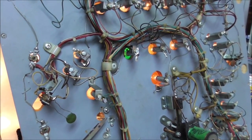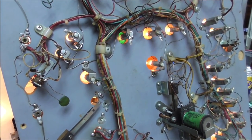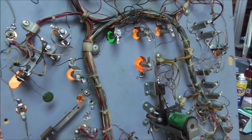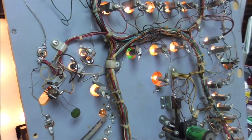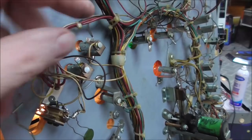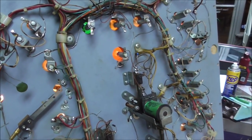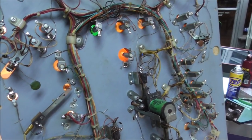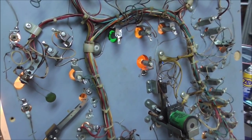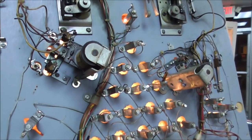to replace the socket. Sometimes you will have a socket that's real loose, where the press fitting is completely broke loose and it's just wobbling around. Those are kind of dangerous, because what it'll do is it'll short the two wires together eventually. Whenever it moves just right, it'll short, and it'll blow the SCR on the lamp board or blow the fuse, and then it takes you a little while to find it. So if you've got one that's real loose, where it's kind of hanging apart, go ahead and replace the socket.